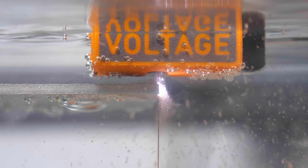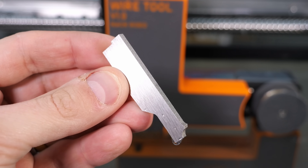Why do we have it in water? So you've got a high voltage potential and a ground potential between your work and tool. If you initiate a spark in air, there's no way to cool down the stuff that vaporizes away. So in order to cool that vapor down and get it into a little sphere of waste, we have that in water. The other reason is water provides a relatively consistent dielectric constant — you need to break down the dielectric to get a consistent machining effect. Water does two things: it clears away waste and produces a consistent spark length.